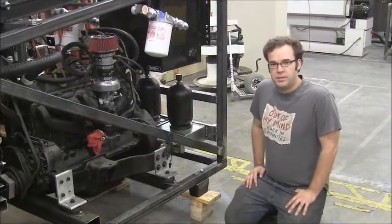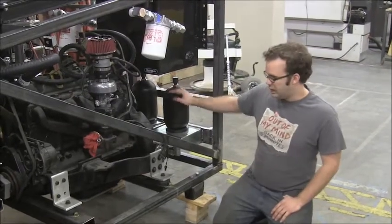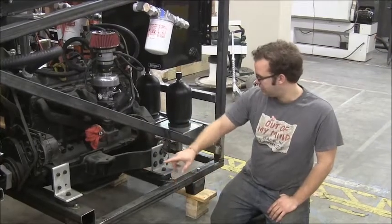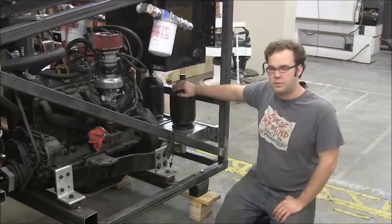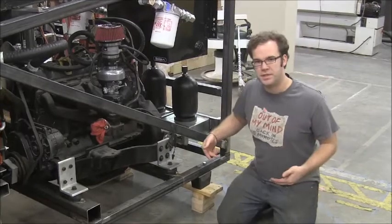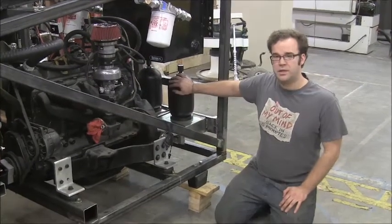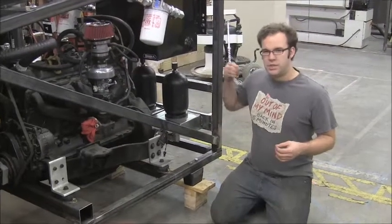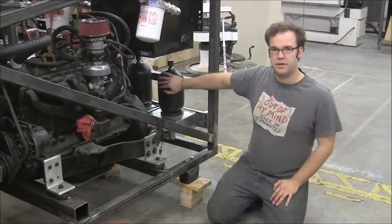Last week we talked about hydraulic accumulators. These are the two we have — each one-gallon accumulators. Pressurized fluid comes from the pumps, goes through our relief valve system, and feeds into these two giant accumulators. They make sure any pressure spikes or pressure drops in the system get accounted for. For electrical engineers, these are the equivalent of capacitors. As we sharply open or close valves, we need to handle those impulses — these do that for us.